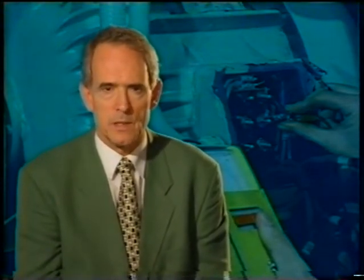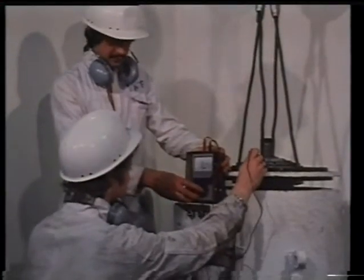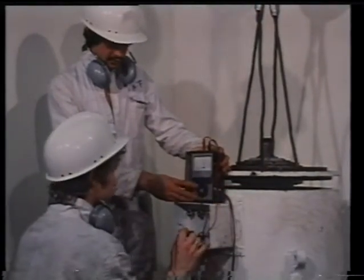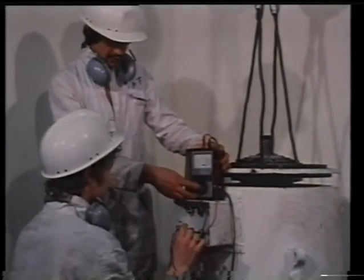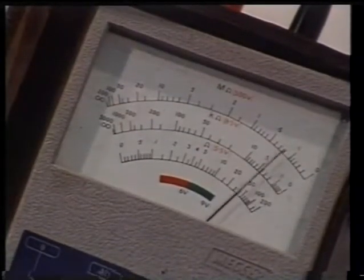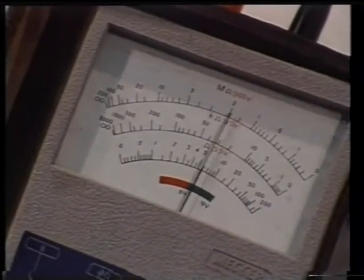A typical example of insulation resistance testing occurs when a water-drenched motor is dried out. Start by testing the meter, and then find 2 good earth points. Now each phase is tested to earth. You can see that the reading indicates very low insulation. The motor needs to be dried out.